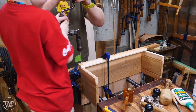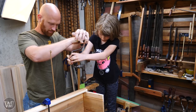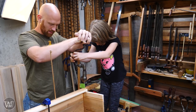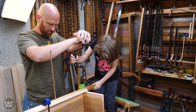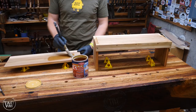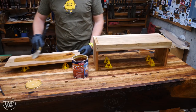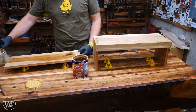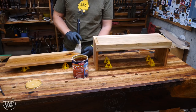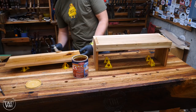After that, we put the two rails on the side — one pin into either side board and three pins into the bottom board. This holds the sides together and keeps the food from spilling out. With that done, it's on to adding the finish. I love boiled linseed oil and paste wax, but it is not a good exterior finish — it fades quickly and isn't very protective.